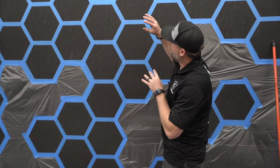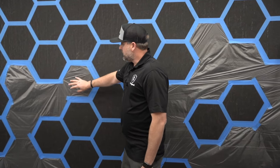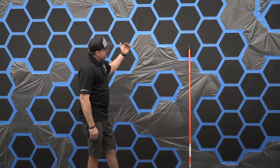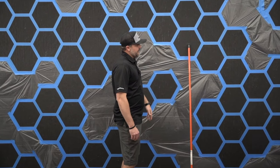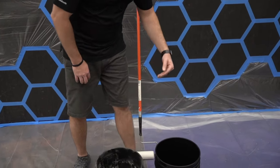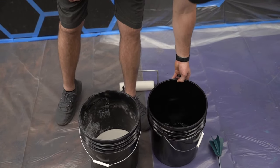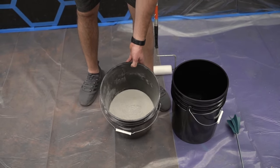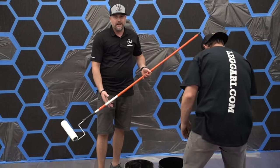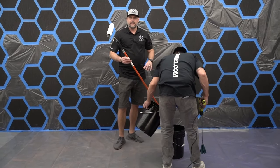We've got everything plasticized off — the floor and all the spots we do not want to coat. Now I'm going to mix up our black scratch coat and roll it on to seal up the wall. For a larger wall like this, I'll roll it; if it's a smaller design, you can just take a paintbrush and paint in the edges. We have our concrete overlay, our black polymer already pre-measured, and our concrete overlay scratch coat — it's like a paste. Ryan's going to mix this up, and then I'm going to apply it — dip and roll like you would paint, nine-inch roller, three-eighths nap.